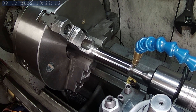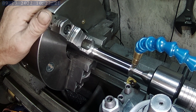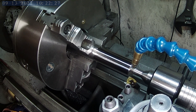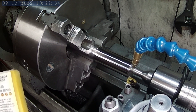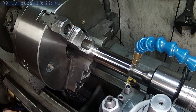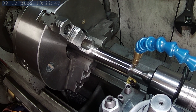Alright, so in the chuck here I got a piece of 4140. Last time I used 12L14, but being that we're testing these out I wanted to give them something a little bit more challenging. So first, representing the land of many affordable things, we have from China the WNMG 431. I'm going to be turning these at 150 RPM and we'll go with a 10 thou step cut. Let's see what we get.